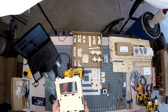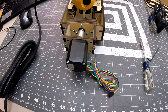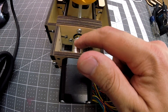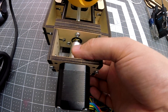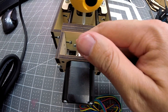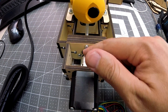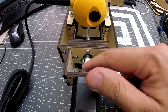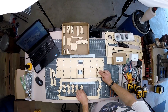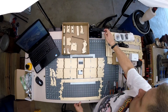The router housing was complete and it was time to move on. Here's a tip when putting your motor on: don't tighten this piece down until you've actually got it on — slip it on the end of the shaft first, then onto the threads, and it'll save you a lot of time. Tighten it once it's seated, otherwise you'll have it in the wrong spot. Now it's time to get the sides on. If you notice the squares in the center of those boards, those are for making adjustments later.